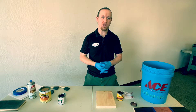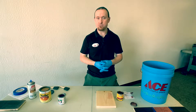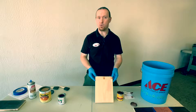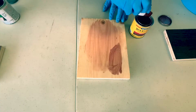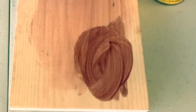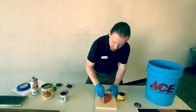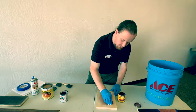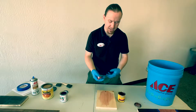In this demonstration I'm going to show you why you want to sand down to bare wood to make sure that you've removed all the previous stain, sealer, or wax. Here's a piece of wood that I've treated with wax so you can see why you want to make sure that everything's been removed before you start staining. I'm going to get a lot of stain on this — and as you can see it's already starting to bubble and it's not really going into the wood to stain it. If you notice, I can take this stain off really easily, because that layer of wax is preventing the stain from penetrating inside the fibers and giving it that lustrous stain.